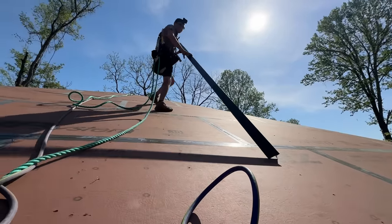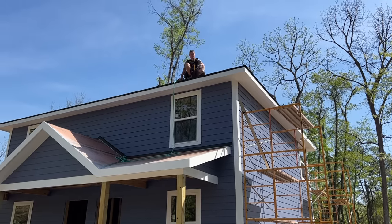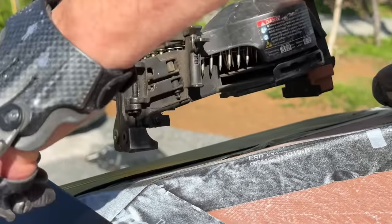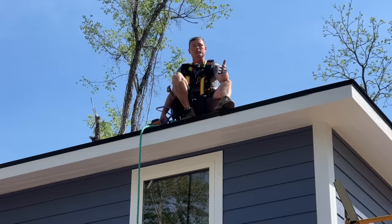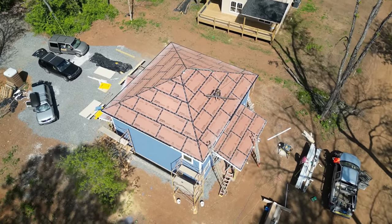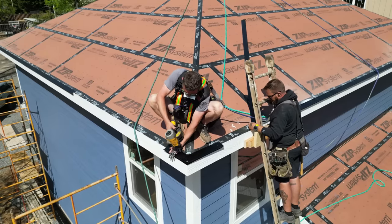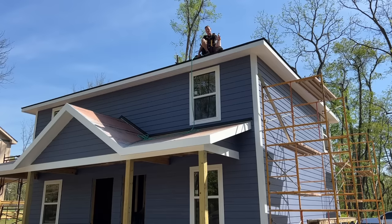One of the main reasons I wanted to install this drip edge myself, even though I would say it's the roofer's job, is that it's going to be a while before we put the shingles on, because I want to get the plumbing done so that the plumbing vents are cut through the roof and nobody comes up here to cut a hole in the finished roof to install a plumbing vent in a boot. In the meantime, if it rains, water's just running down our finished fascia, which is completely painted and done. If it's exposed to running water like a waterfall for a couple weeks, it could potentially get streaky from the dirt from our feet up on this roof, and we might have to repaint it again. I don't want to do that. So I think it's easier to put the drip edge on myself and zip tape the top edge of the drip edge so the water will actually clear the fascia and not run down it.